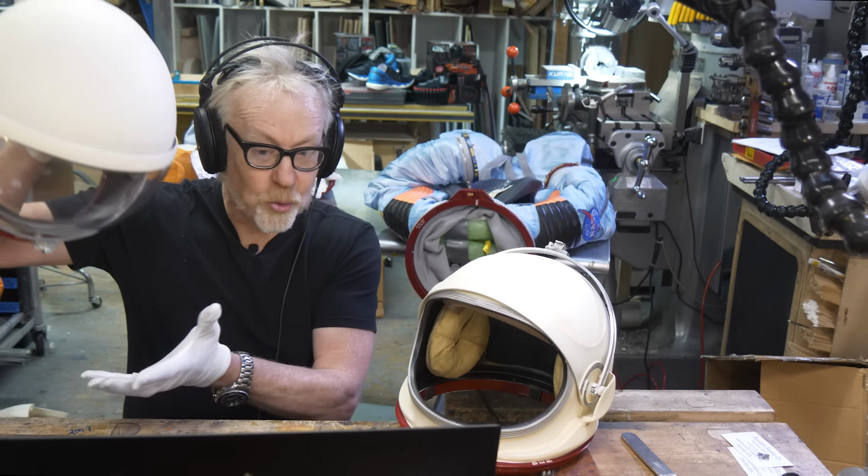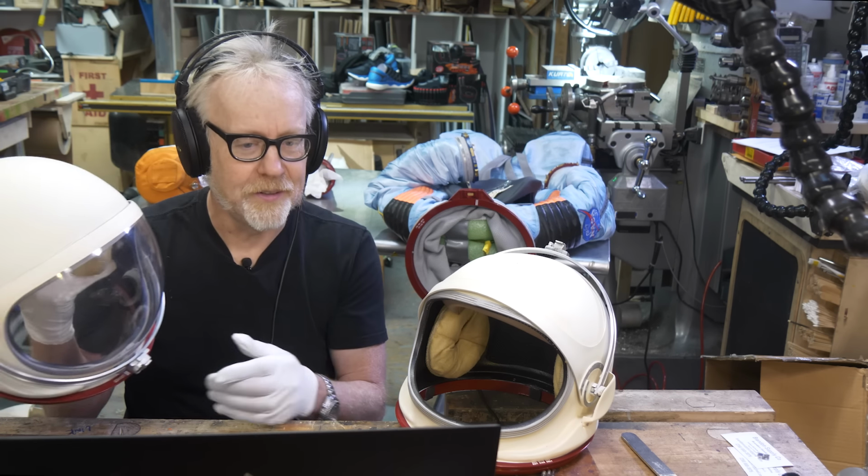And you pulled these visors in your shop. Yeah, those are pretty clear as well. They really are. And I actually do those in silicone molds. I've found that vacuum forming clear plastic in a silicone mold probably yields the most optically clear result. And do I remember correctly, you pull it into a negative rather than over a positive? I pulled the mold for that visor out here.